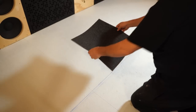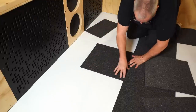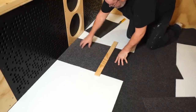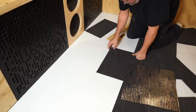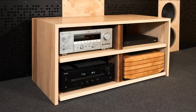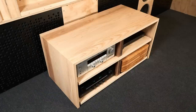To start laying the carpet tiles, I snapped a chalk line after carefully measuring out where I need to start. Really what you want to wind up with are pieces on the sides and on the front and back that are not too small when you cut them, so that you're not left with a little sliver of carpet tile to fit in. I only did a little bit more than the front half of the room because I built that equipment stand from ash and walnut and that's going in there. I wanted to get a decent looking thumbnail to try to get some views on it — didn't work — but worth the effort.